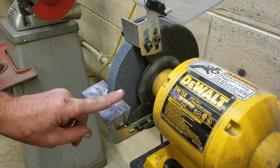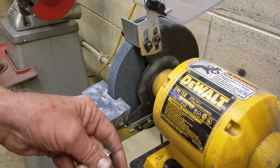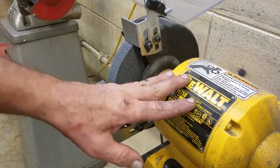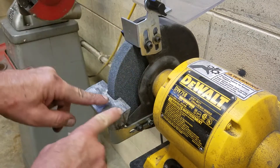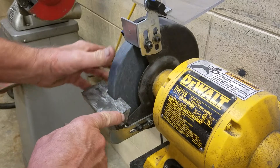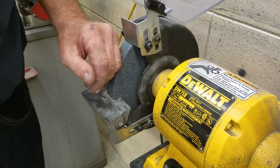I set the tool rest on the grinder at 12 degrees. I'll show you how to do that in a minute, because you can't go off the center of the shaft — it'll be quite different. We want to make sure our grinder is set with about a 16th or less clearance at the spark guard and about a 16th to an eighth at the tool rest. Make sure wheels are not cracked — spin them around and see how they feel. We just put these on and give them the ring test, tapping them with the end of a screwdriver.